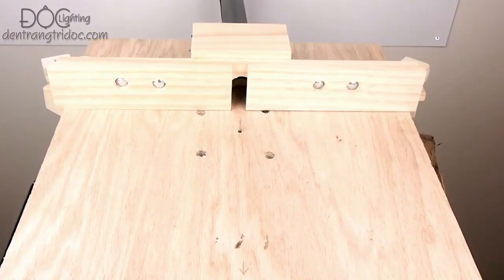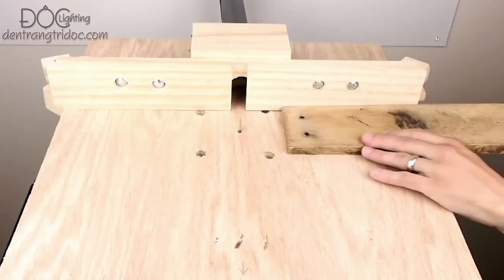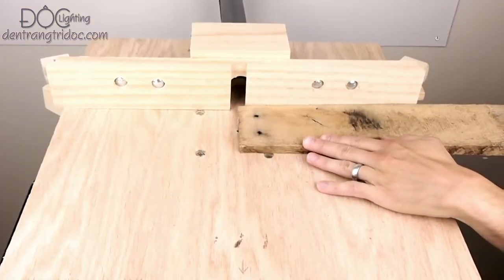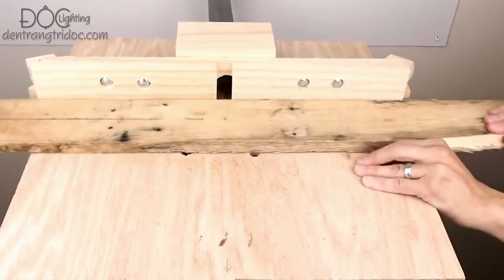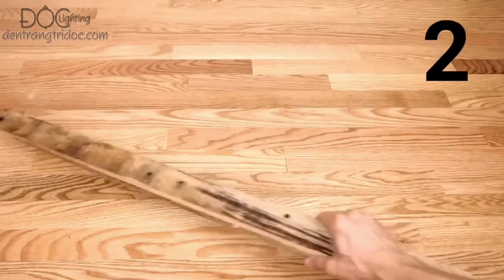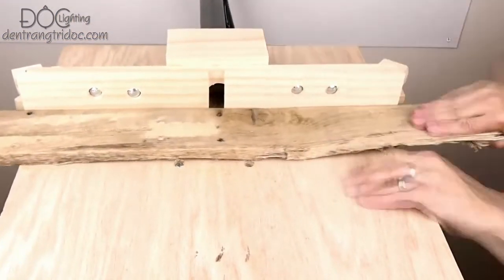My pallet boards were about 3.5 inches wide, but I cut them in half. I used my homemade router table with a 1/8 inch spiral bit. This is not an ideal way to rip boards, but it's about the only way I can do it, so I did it this way. A table saw or even a bandsaw would be much better, but sometimes you have to make do with what you have.